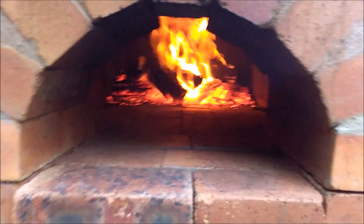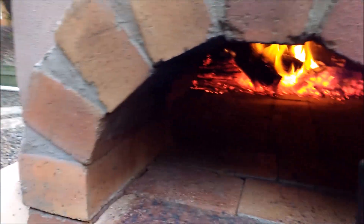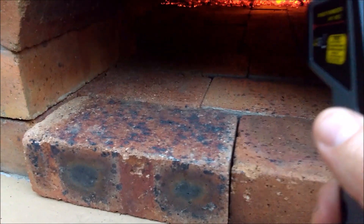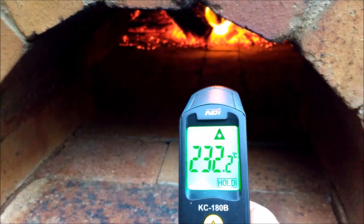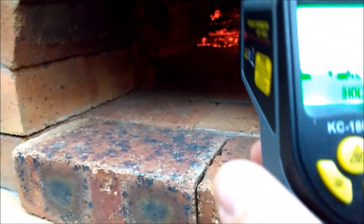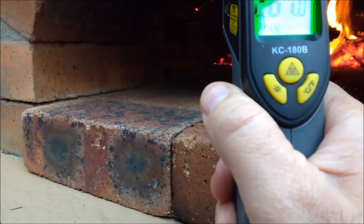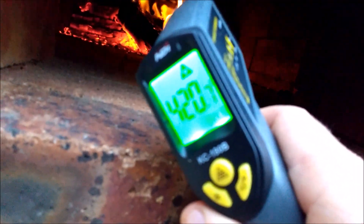Next thing I fired it up. You need some good quality seasoned hardwood to burn. It can take a while to get the heat in and get it burning properly, but once it does, it burns really well and it's nice and clean. Just measuring temperatures on the floor — about 200 degrees Celsius. That reading was 172, and there's 248 closer to the fire. On the roof it gets up to 400 or 500 degrees. A wall temperature about halfway up was 310 degrees Celsius. So it definitely gets quite a lot of heat.